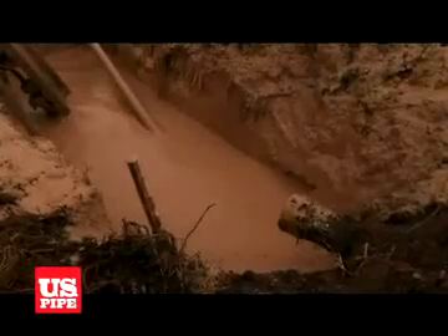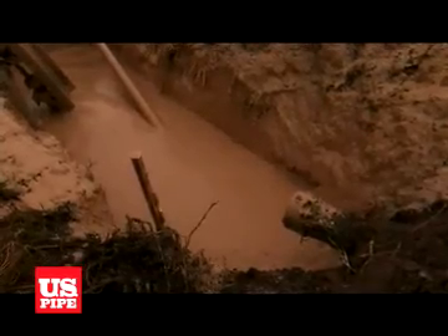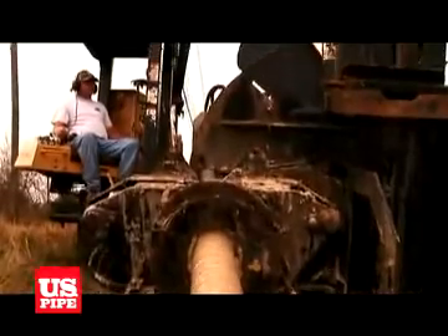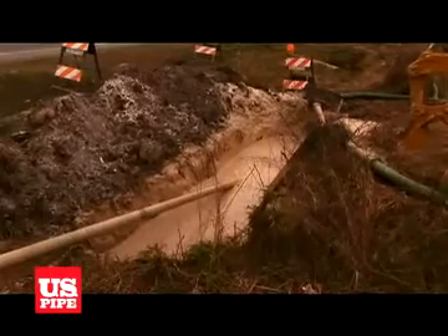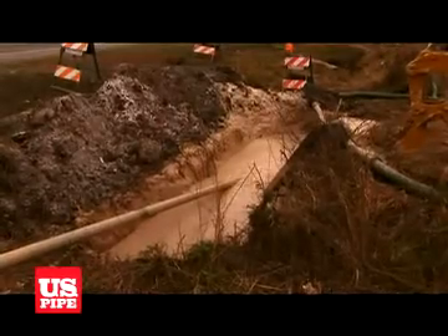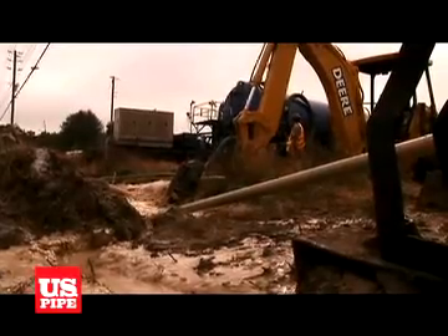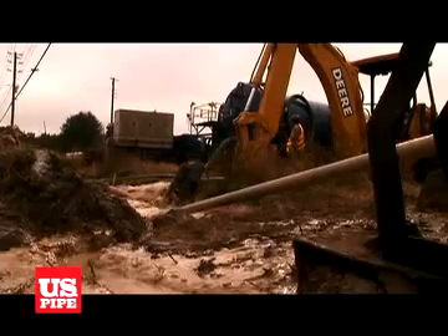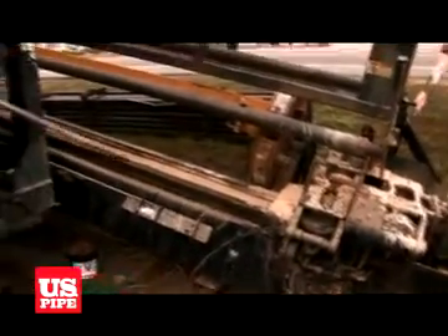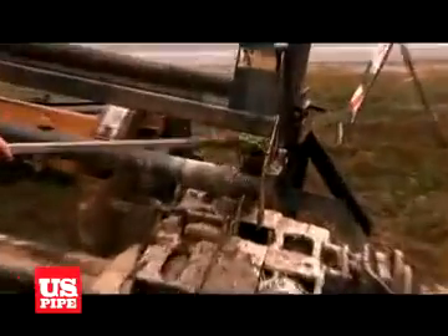The drilling process is the same as for any other pipe material. The industry standard practice for pulling ductile iron pipe is to use a borehole that is 1.5 times the bell diameter for curved or radius pulls, and 1.25 times the bell diameter for straight pulls. It is also industry standard practice to limit the radius of curvature for the borehole to half of the joint's deflection capability.